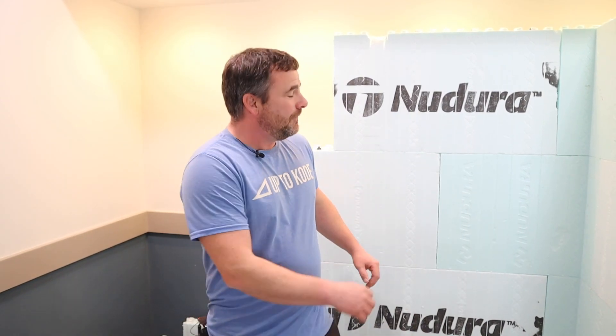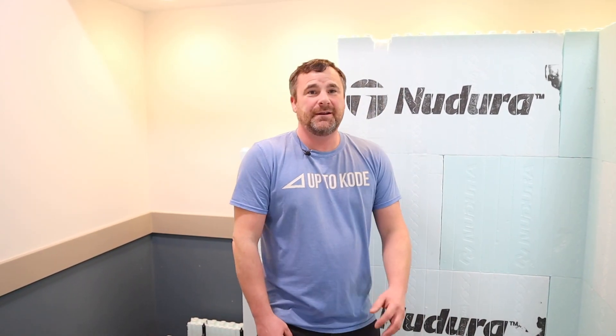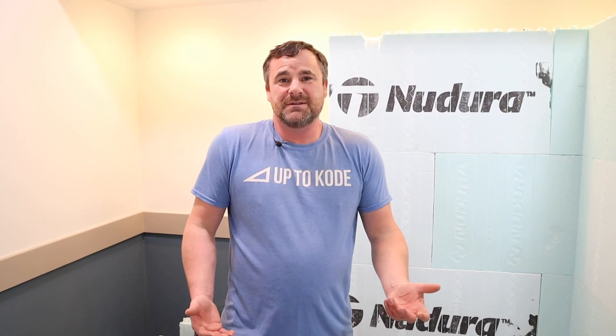So that's a wrap for today. I wanted to show you how we've achieved those numbers, and basically we didn't go crazy — we didn't have to. It's all built into the ICF. My favorite part about it is if I fell into the wall and gouged the foam, I didn't wreck my air tightness. I could hang a thousand photos in the house when it's all done and I'm not going to punch a thousand holes in my poly. You'll never wreck the air tightness of an ICF.